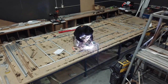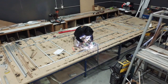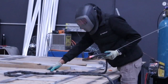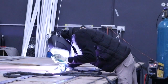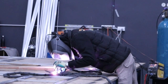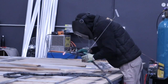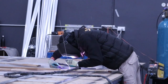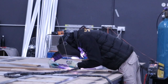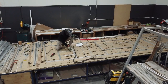Our method of TIG welding our aluminium frames for our caravans is that we use a combination of tube and channel through our whole van's structure. The structure is set and sound, and we use 40 by 40 tube in the bottom, centre and top of the side of the van. We use a 40 by 40 tube for the full roof, and we use a channel and a tube through the sides of the van which gives us a flex structure.